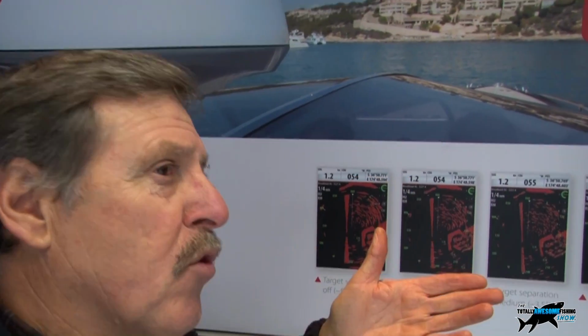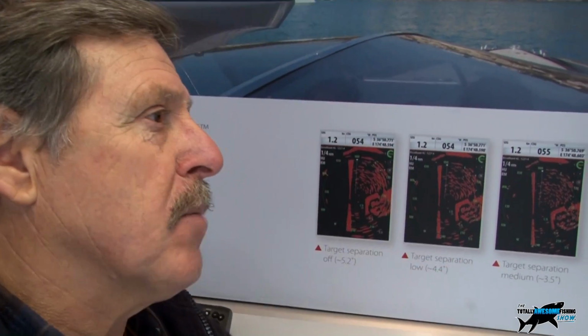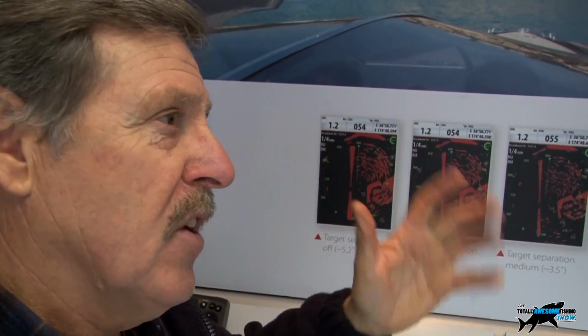Now Craig, on my boat I was running once and I lost a signal, which I thought was because I was going too fast, because obviously the faster you go, I don't think you get such good definition, and my pal altered the ping speed. As you were saying, if you run over too fast and you've got a slow ping speed, by the time it comes back up the boat's gone, and he increased the ping speed and I got better definition. Is there any truth in that or not? Yeah, that's it exactly. On a lot of these boats now, you've got guys on these day boats running boats which could do 60 miles an hour to get out to their fishing spots extra quick, but that is the problem. Once you get up to these high speeds, the problem you were seeing, the way you altered it was to adjust that ping speed.